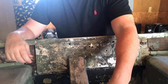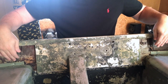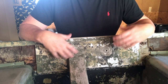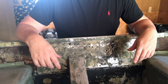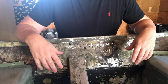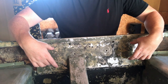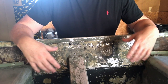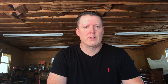If I can leave it attached at the bottom I will, and then I'm going to try to get this old rotten transom out without taking these storage lids out. Then we'll get a new piece of wood and try to get that back down in there. I've got a friend with a welding shop, but I'm not sure I want to re-weld this — down the road that might be a pain. I'll probably just go with a couple of bolts to keep it attached. That way, if I need to take this plate off or do something with the transom again, I'm not running back and forth to a welding shop every time.